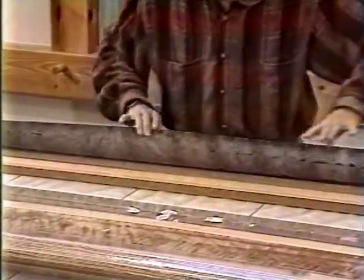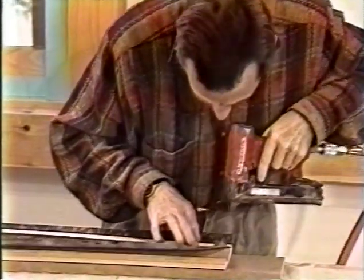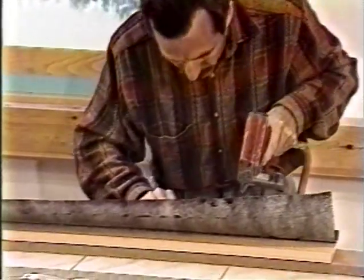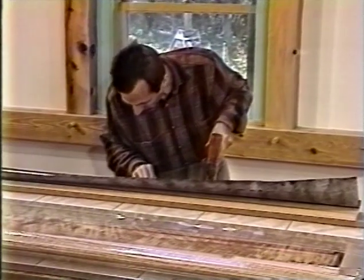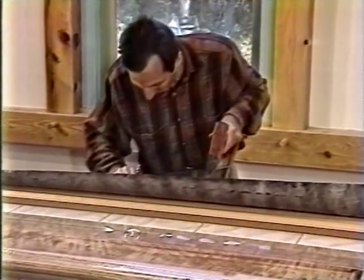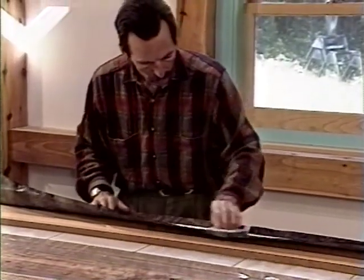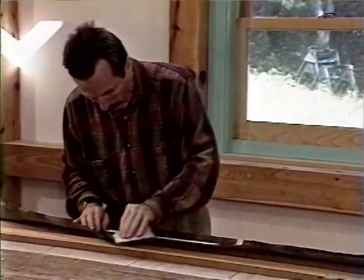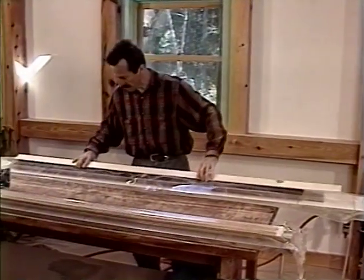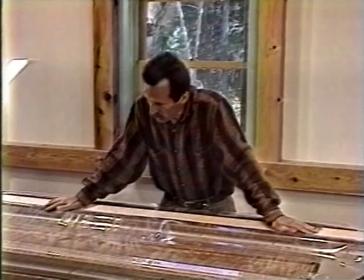Next, I'll tuck the veneer into this place, and nail the strip on top. This helps register the cut in the veneer, precisely over the inside angle. Wet the surface of the veneer lightly and put it in the bag. Again, I'll use this piece of wood on top of the bag where the OG dips down until the bag begins to apply pressure.